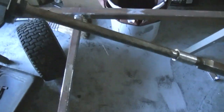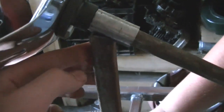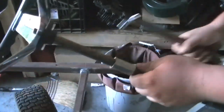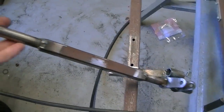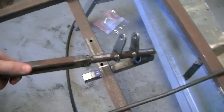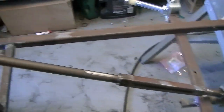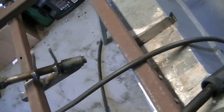Right now we're trying to get that piece ground down at an angle so it fits in here. It's almost to the point where it can be welded on without much of a gap, but there's still a little gap so we'll keep working at it. The top mount is now welded in. You push it in on this side and since these have a little bit of play I'll slide it up, push it back down, and put a shaft collar on the end with a set screw so you can't pull it back.